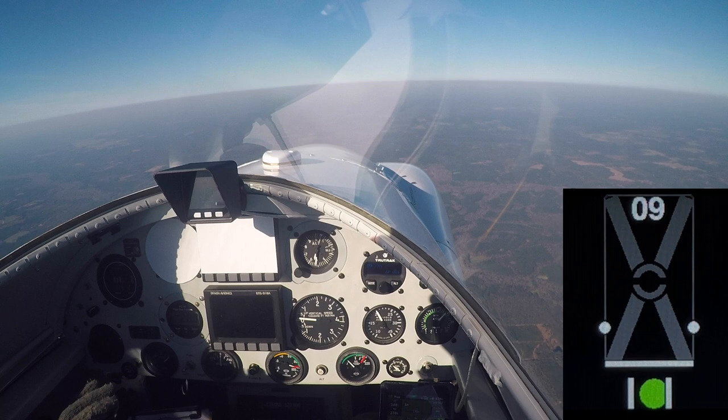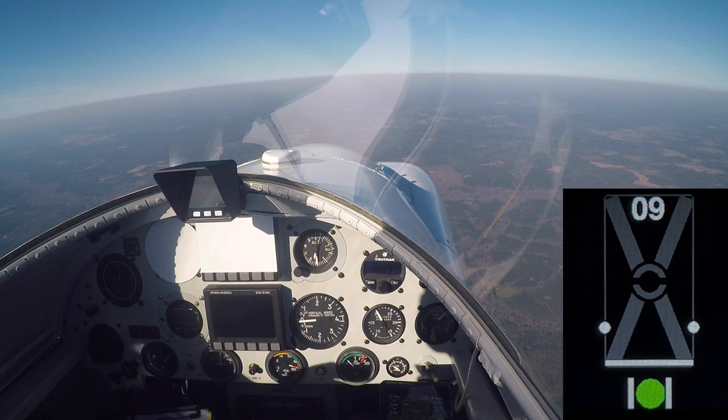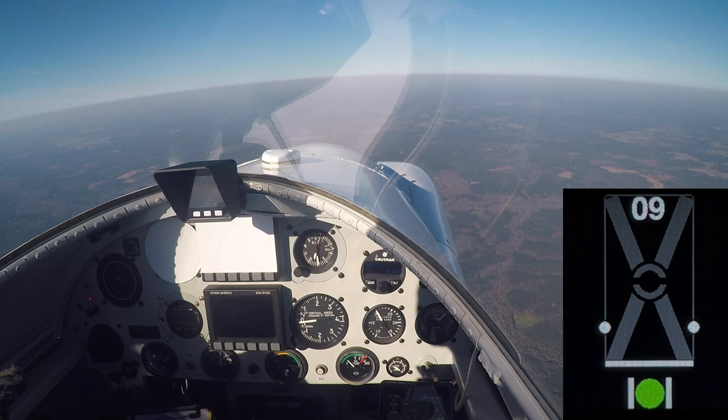Now, this system actually just has a tone that comes on at L over Dmax, corresponds with a visual signal for L over Dmax, and we call that the fast tone. And you're going to hear a low-frequency tone with increasing beeps as the airplane slows down until we get to an on-speed condition, and the tone is going to go steady.